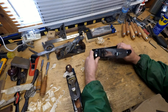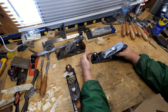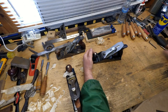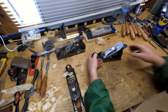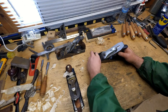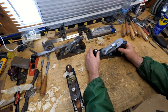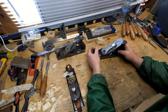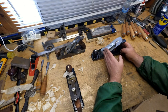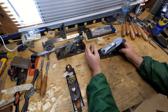I had to sand the flashing off of the front handle so it didn't feel like a little plastic knife jabbing into my hand. This screw doesn't go flush into the handle — it sticks out an eighth of an inch all the way around, so that's your handling surface. Even though they went to the expense of a faux brass screw because that was traditional. Somebody had an older Stanley that they copied to make this one — they just did a really cheap copy job.